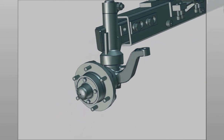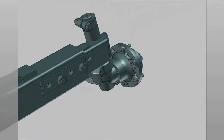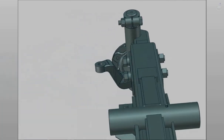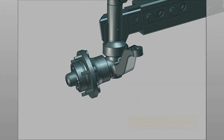The hubs of these axles are sealed with grease and there is no additional greasing point provided. The greasing life recommended for the hub is 2000 hours. Always use LCG grease while greasing hubs.